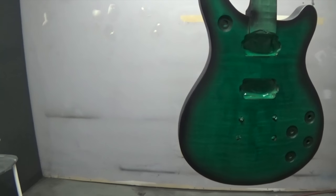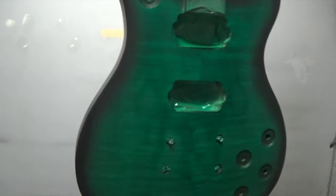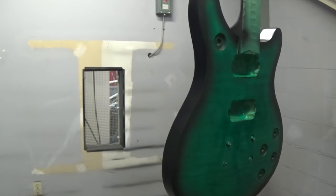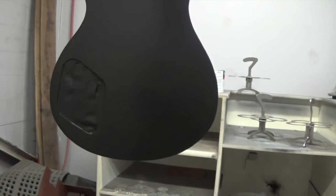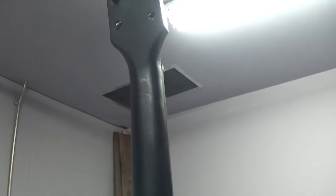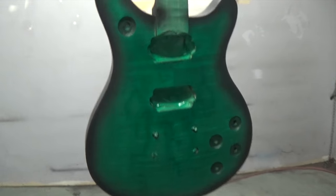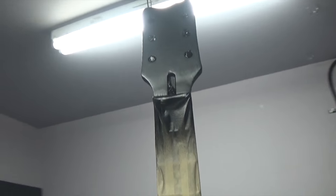There we have our black on. The light vignette is done — it's pretty thin, which is what I was going for, so it still reveals as much of that flame maple as possible while covering up all the imperfections we were dealing with. I put it on nice and thin but have full coverage, so I'm happy with it. Pretty much all that's left for color before we move on to clear coat is something a little more interesting on the headstock.